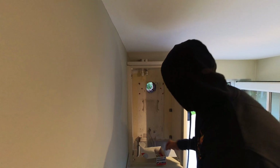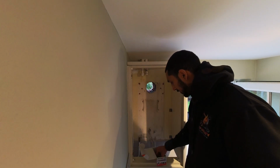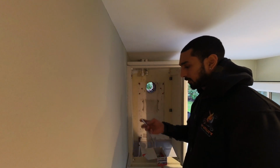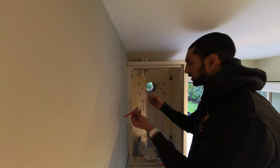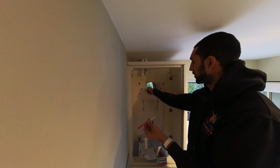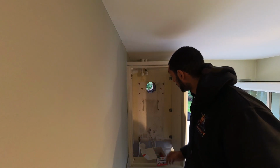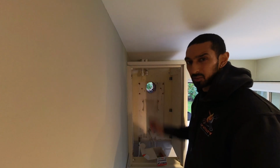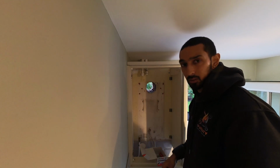These are great for dot and dabs because it's got a long plug, you've got a metal insert that then goes into there, and then you've got these long screws, so they'll basically just go through the plasterboard, through the gap, into the blockwork. Oh my god, it's starting to piss down proper. So yeah, because it's a bit of a crumbly wall, I've used all of the fixings. Make sure we get a good solid fixing.